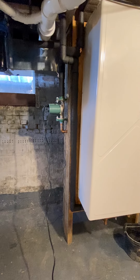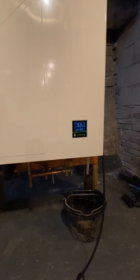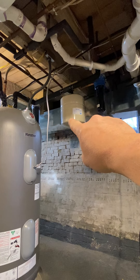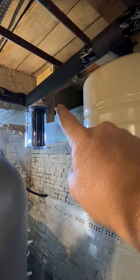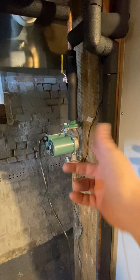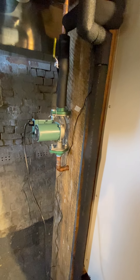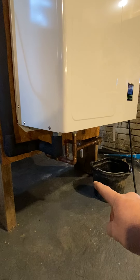In this case, it's got its own little separate structure I built for it. It is currently 53 degrees Celsius, which doesn't give me the option to go to Fahrenheit — I believe that's close to 120 degrees Fahrenheit. I plumbed in from the fresh water supply on the other side of that tank. It comes in the second pipe to the right, through an additional carbon filter, down into this pump. This is a zone pump — a hot water pump designed to keep constant hot water in the system. It goes back behind into the bottom of the tank, which is the inlet side.